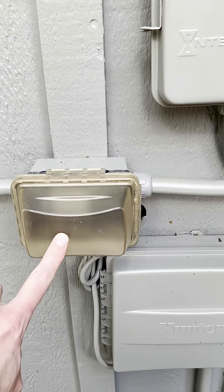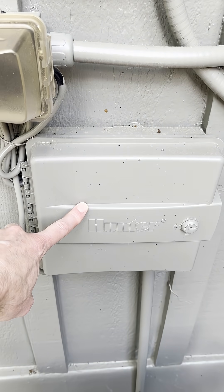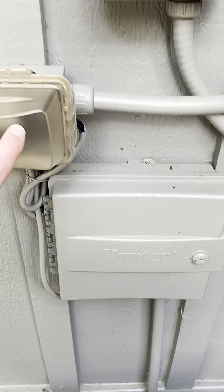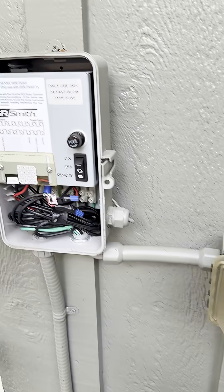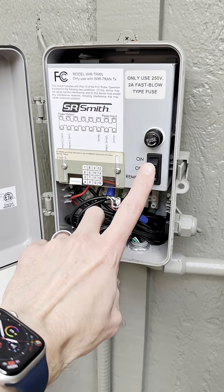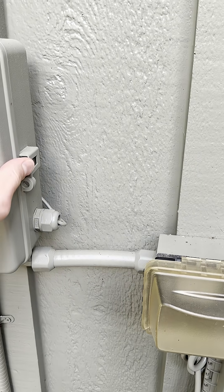Over here, we just have the GFCI. Currently it's plugged into the lawn sprinkler controller. I don't believe that that was it. But this lighting controller right here was the culprit. I flipped this sucker to off and the noise went away. Let's go inside and check it out.